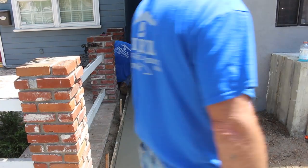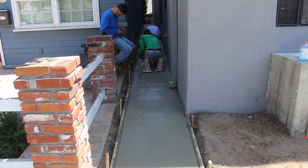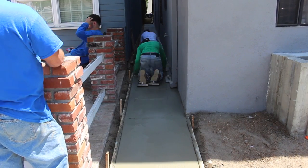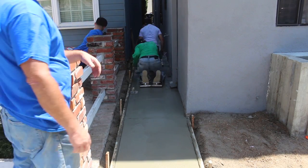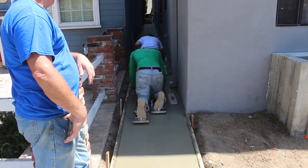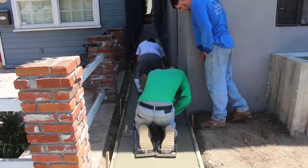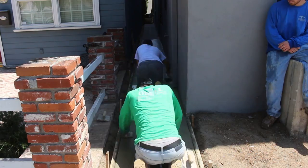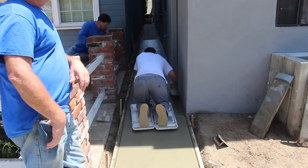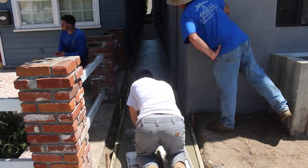We've got Sam on his new sliders — this is about his third job on them and he's gradually getting better. My son's behind him also on new sliders: one of them went with fiberglass sliders, which is what I prefer, and the other went with metal sliders. It's a good combination — when it gets real hard and you're doing a hard trowel, the metal sliders are probably best. But if you're doing stamped or broom finish like I normally do, I'd recommend fiberglass. For garage slabs, hard trowel, or machine foundations, metal sliders are probably better.